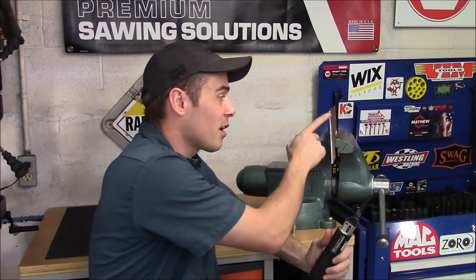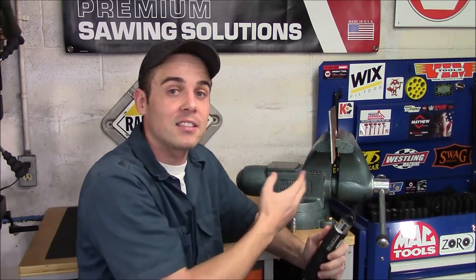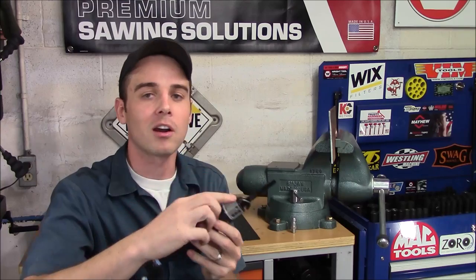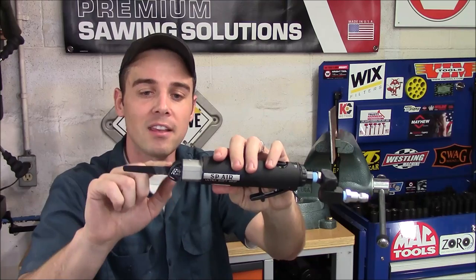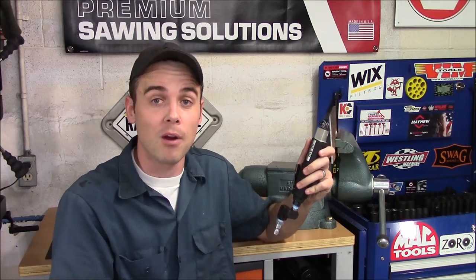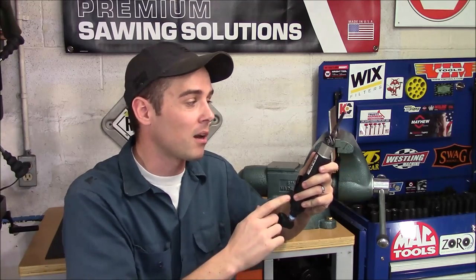It had a very clean, burr-free finish, and the blade was still in perfect condition when we were done. One cut as long as this is still not going to damage your blade, where a typical saw probably wouldn't even make it about an inch in without giving up. One negative I want to point out is that the blade guard is not extendable. So unlike a standard reciprocating saw where you can move the guard out and use the portion of the blade that still has good teeth, this is not adjustable — so when you wear the teeth out directly in front of it, you would need to replace the blade. That said, if you use quality blades like the SP Air blades, that shouldn't be a problem. But if you buy knockoff blades, you'll probably go through a lot of them in the same amount of time you would go through one quality blade.